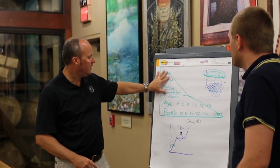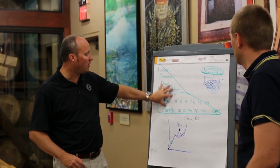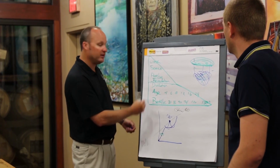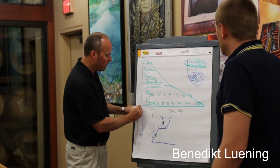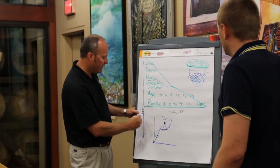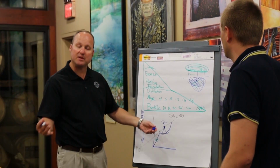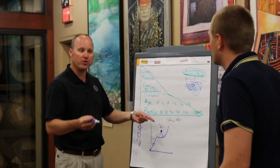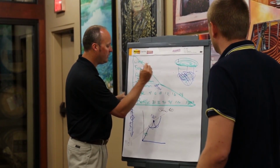For us, it's about coming down here, defining our quality, where everybody else does all these different formulas and things like this. Maker's Mark, we have a linear model. We only do it one way. We only have the one water source. We only have the one formula. We only have the one way to prep it and cook it. We only have the Samuels family yeast. We only distill at the low proof, 120, 130. 120, and then 130 on the doubler.